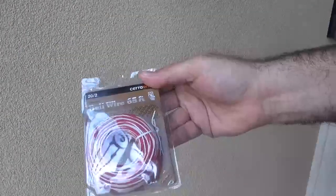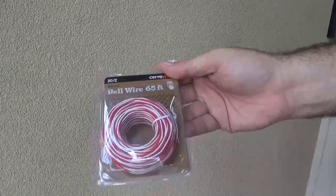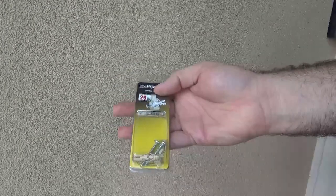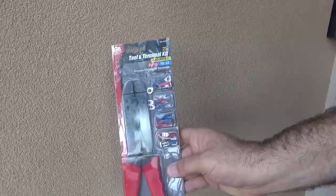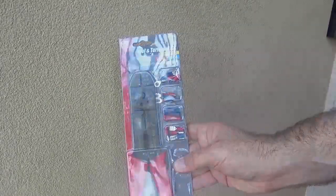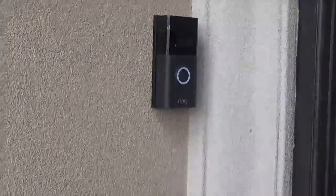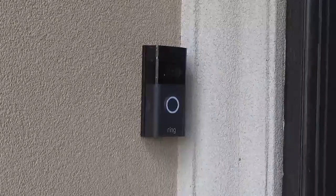Let's go over some of the materials you're going to need. To start off, you're going to need some bell wire cable. I'm going to put a lot of these products in the description below if you're interested. Make sure it's cable meant for doorbells. Since I threw my old doorbell away, I bought another one to put where I'm leaving the opening. You'll also need mounting screws, a wire crimper, stripper and cutter, the right drill bits — mine asks for a one-fourth inch bit — something to hide the cable so it's not exposed, and of course your drill.